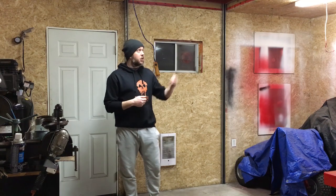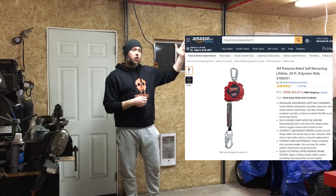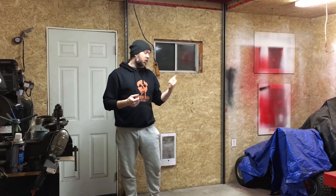The last safety concern some people have brought up is fall arrest. I currently don't have a fall arrest system in place — whether that would be for me to link myself up to the beam overhead, or something connected to the beam that's sturdy enough to catch the lift frame itself if it came down. You'd want to take into consideration your maximum loading so you can have a fall arrest system that would stop that load from falling and crashing to the ground.